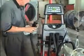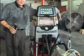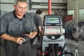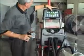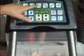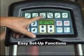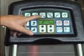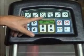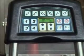The machine comes with a full range of dent pulling functions. The most common of which is dent pulling with nails or studs. We have a separate mode for that and 4 memory slots, so we can program in both a current setting and weld time setting for each of the functions that are on here. Here we have trim rivets, welding with nails, dent pulling nails, wiggle wire, or quick dent pulling with the star washer. So the first application is going to be a nail.